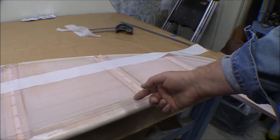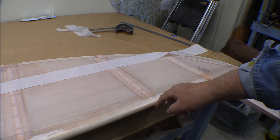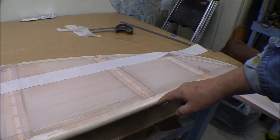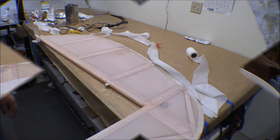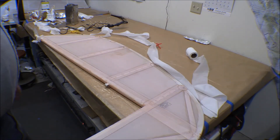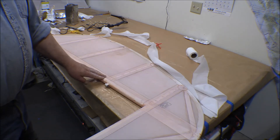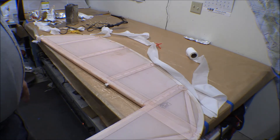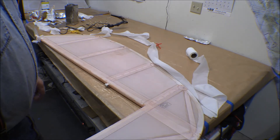I've got this all laid out. I'll put the 3 inch tape on this side and then shrink it so my seam winds up being somewhere along the hinge line of this spar so it doesn't show. This elevator is coming along — I've got the finishing tape here on the spar, on the leading edge spar or the main spar for the elevator. I've been looking at the old elevator for inspiration and guidance on how to do this, and in some cases how not to do this.